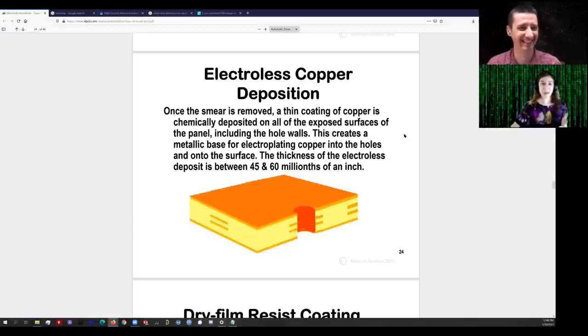There's a lot of physics involved. For those with interest in electrochemistry: copper Cu0 will lose an electron at the anode and become Cu²⁺, which is soluble in water. On the very surface, you have a constant corrosion of copper off the anode into the bath as a copper ion. Then because you have a strong electric field from the cathode of the board to the anode, the ions in solution will migrate — they don't move at the speed of light, they take a finite time and are subject to the motion of the liquid.